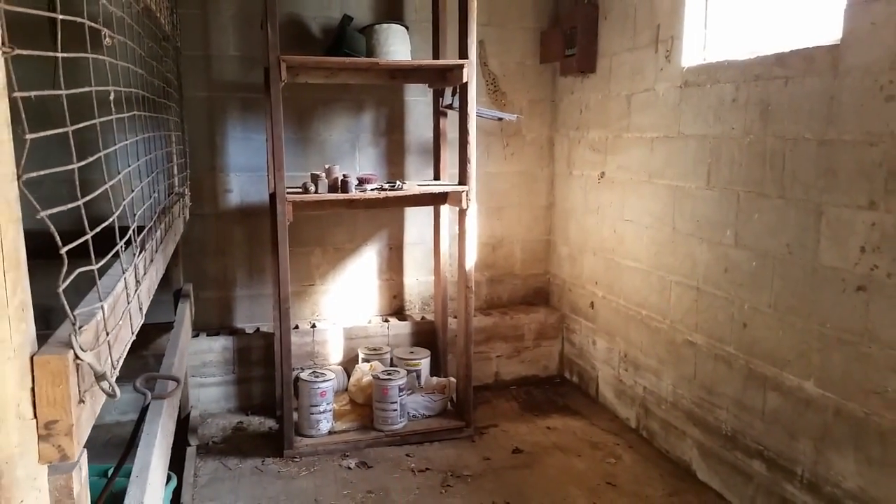When I put these posts back, some of the ones in the back were spaced closer together. I think this is about an 8-foot spacing down here, so I'll probably keep this spacing and end up with one less post in that area. I only have four posts to put in today, so I'll have to nail some together to make a fourth or fifth post.